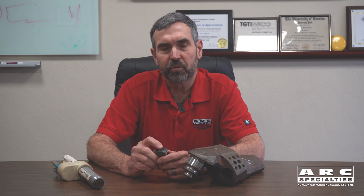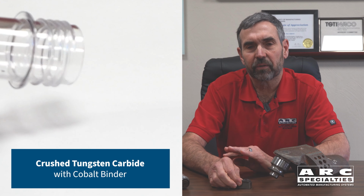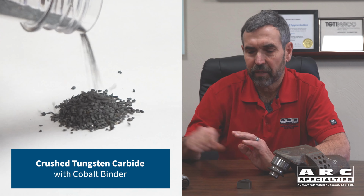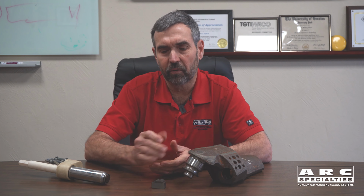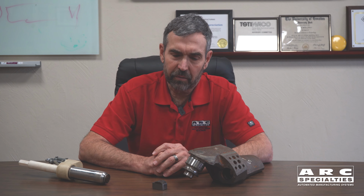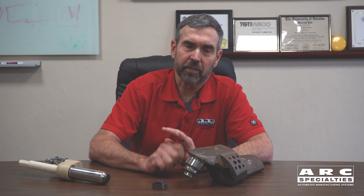The other problem is traditionally they've always used large diameter carbides for this application. So our idea is we're going to go to plasma, and when you go to plasma, you can no longer run these large carbides because plasma torches simply aren't equipped to flow large carbide particles. But when we first started to automate this process for the rock bit industry, nobody believed us.